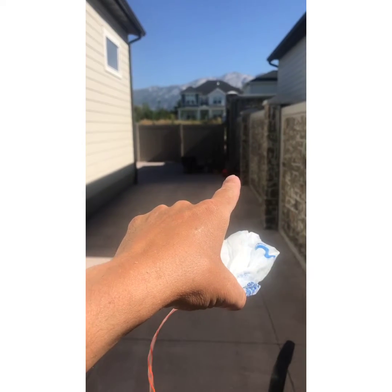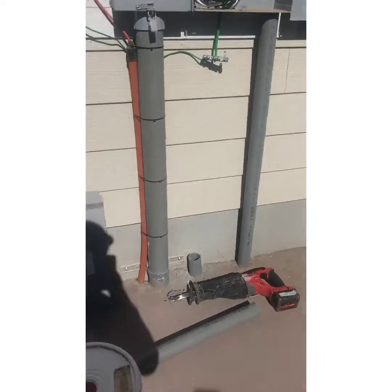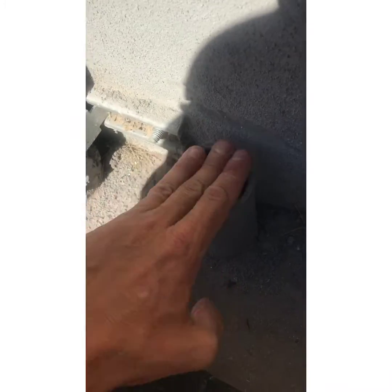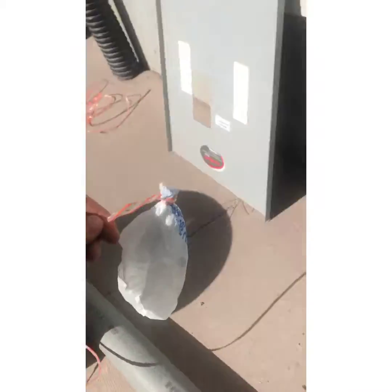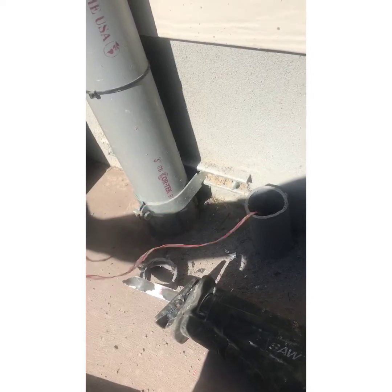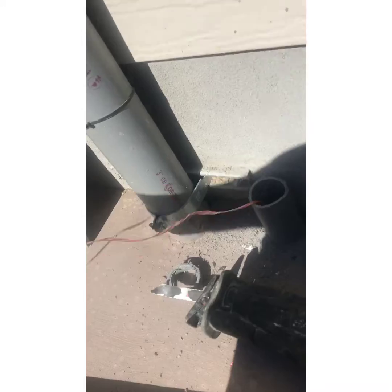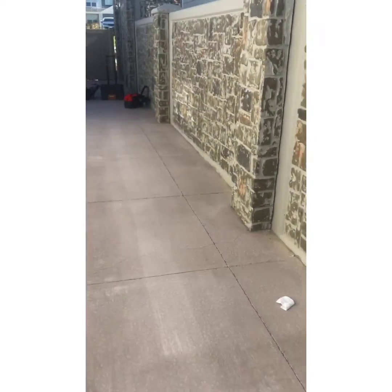Right now I have a vacuum on one end with the hose down into the pipe sucking. As you can see, I can come here and there's air — I've created a mouse and put it on a bucket of string. You can see that string goes and goes and goes. In a second I'll walk over and pull this out of the vacuum. You can hear the vacuum just clog up over there.